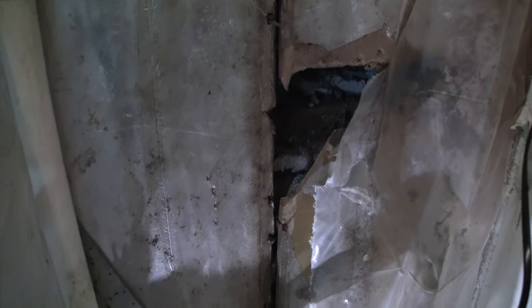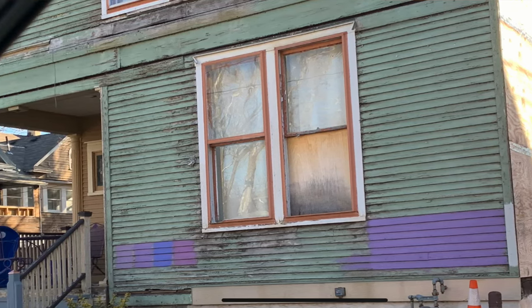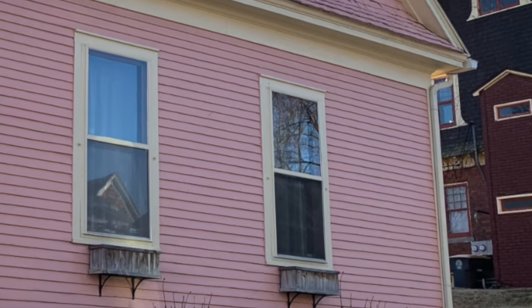The problem is when water stays in contact with the wood, and that's what happens when you just throw insulation into a house that is not sealed — not air or water tight. If you've ever seen an old house with the original clapboard siding, sometimes you'll see what looks like plugs, about two-inch diameter holes drilled into the side of the house. That was used to pump insulation behind those walls from the outside, and that at times can be an absolute disaster.